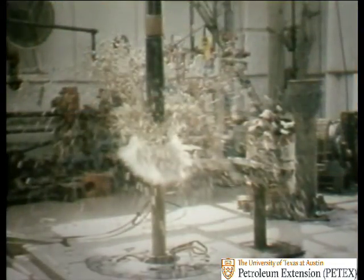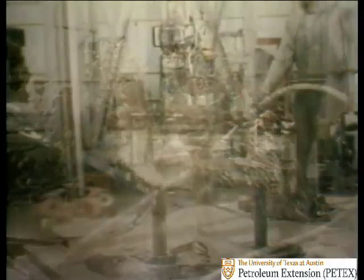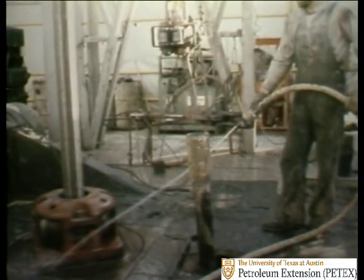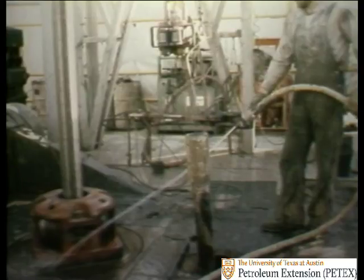Mud's your worst enemy on the rig. Its abrasion causes wear and gets into all the machinery, especially your rotary table. So the first line of defense in a preventative maintenance program is going to be keeping that mud out of the table. That means washing it down after you finish tripping and before you start the table up. If you don't, let's look at what could happen.